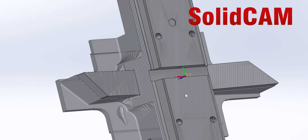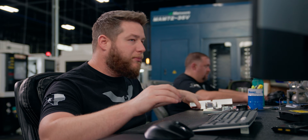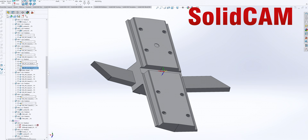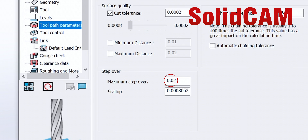Most of this is hidden since it bolts up against the grill, but there will be some side faces visible, so we want to think about that. It's like grilling a good steak — you want to season the sides of the meat, not just the top and bottom. That texture you see here is what we're putting on the sides. I wanted it to be different from the top surface to break the pattern up, so I chose a larger stepover. I'm using a 1/8" ball nose end mill with SolidCAM's HSS toolpath on a parallel cut, with a 20-thou stepover — that gives me those larger scallops for texture.